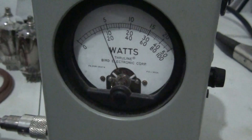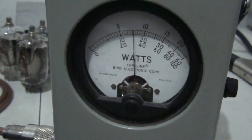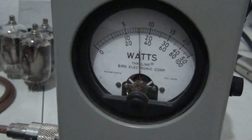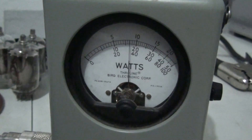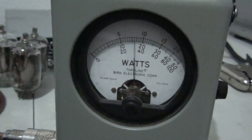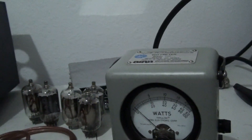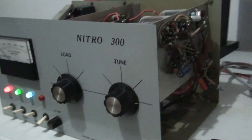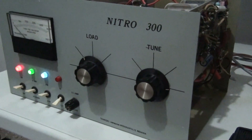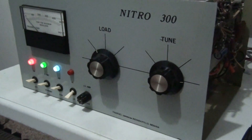A thousand-watt slug, peak kit's on. Doing audio tests - a little bit over 300 watts, and it's climbing too. But you can hear it in the background - it's trying to get a squeal in there. Now, that's not a feedback squeal like a talkback squeal. It's an actual squeal - I don't know if it's a ground loop trying to form in this amp or what's going on, but it tries to squeal.